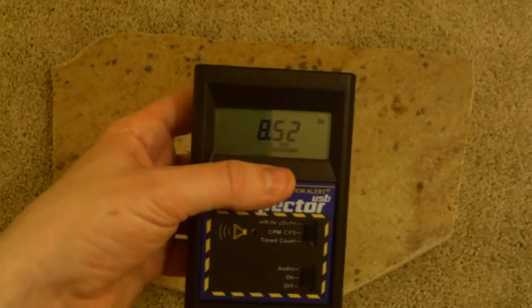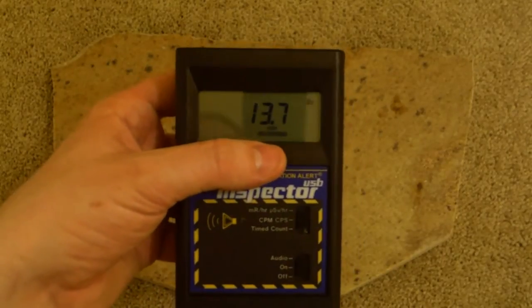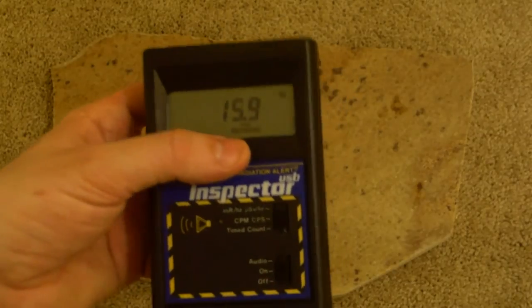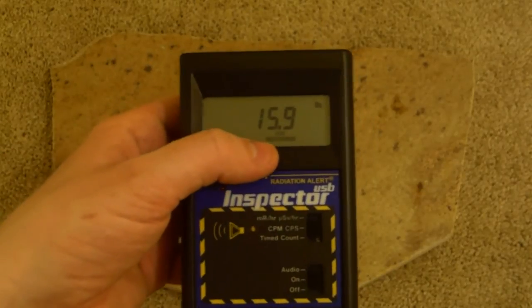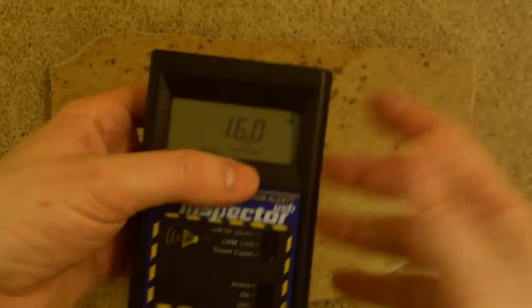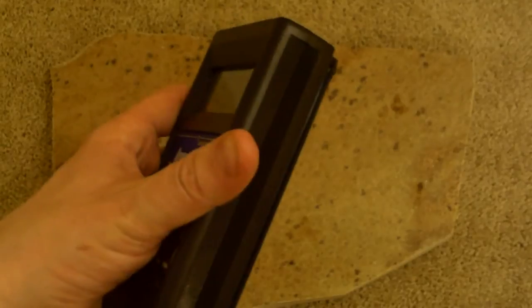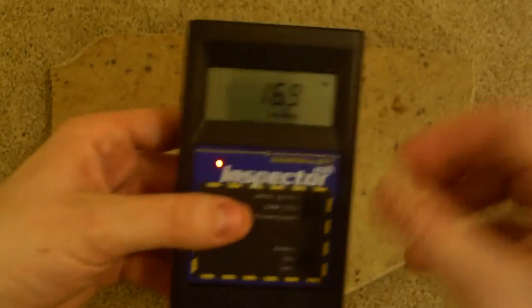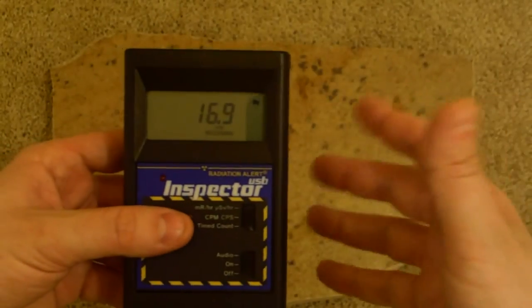Well, obviously there are not actually any becquerels or any decays per second of iodine-131 around me, but it's saying that, look, I don't know what I'm actually reading. I'm not a gamma spectrometer, but if the counts that I'm getting are from iodine-131, this is what the activity would be. That's all it's saying. It's not saying there is any, because it can't actually detect or identify isotopes, or rather nuclides. See, now you got me saying isotopes, and it should be nuclides. But it can tell you that if that hypothesis were correct, this is what you'd